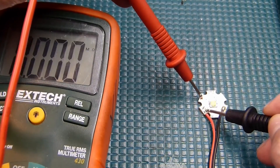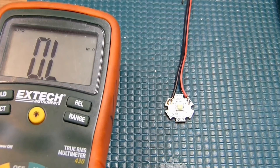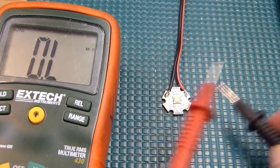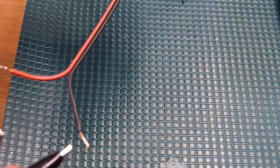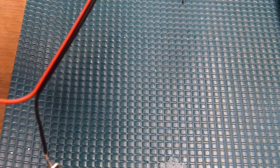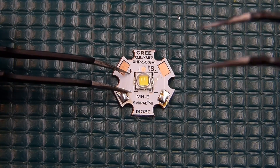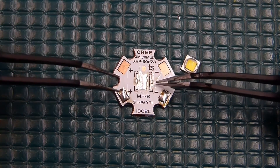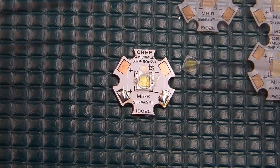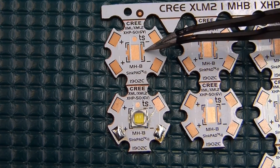Here's that new one where I did the pre-tin. I'm checking for shorts, then doing a power test — and there we go, we're blinded! I noted a couple of solder balls on each side of the LED chip after soldering, and it looks like there's some masking removed creating a little peninsula. Looking at the unprocessed stars, you can see that little peninsula feature.